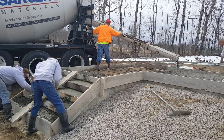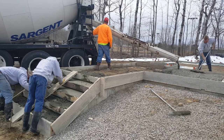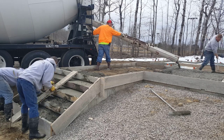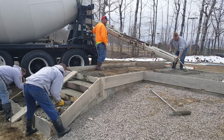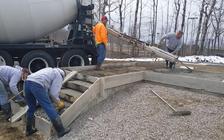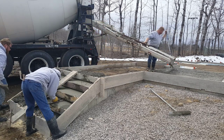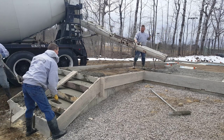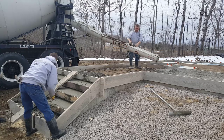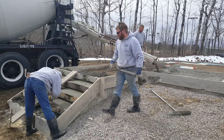Me and Darren are being quite fussy on these concrete stairs. Those risers have a 45-degree bevel on that bottom edge so we can get our mag right under them and get it right to the bottom of the riser. We'll get it really good — we're pretty fussy on them — and then we'll just leave it until they're ready to start finishing. It does take a little bit of time. These are six feet wide and there are four risers plus the patio.